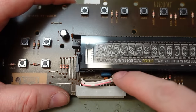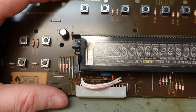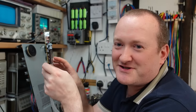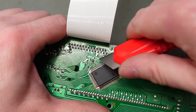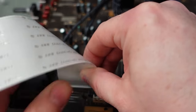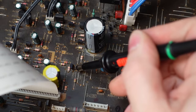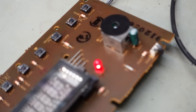There's not a great deal on this side of the board, but here is the resonator — that blue part — and there's a 10k resistor and a little capacitor, all involved with the reset circuit. These are quite reliable parts really — I don't see those failing. Which is a shame, because if it's the microcontroller itself, this thing's for the bin — the first one on this channel I couldn't fix. I'm just going to cut the track to see if this stops it pulsing. It's dead. There's nothing I can do to save this one — they stopped making this chip 20 years ago, parts aren't available, and even if you could buy one it's programmed with Denon's own software. The micro is dead — throw it away. Look at it glowing away like the saddest HAL 9000.